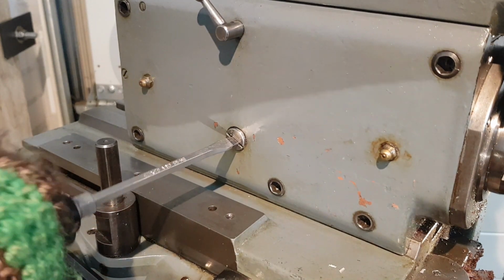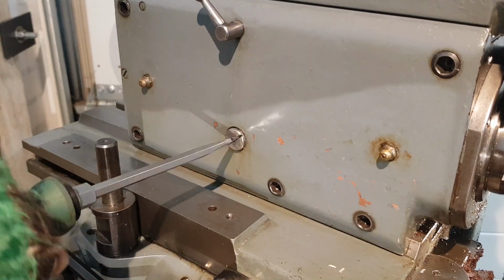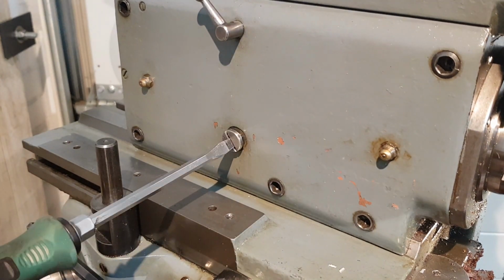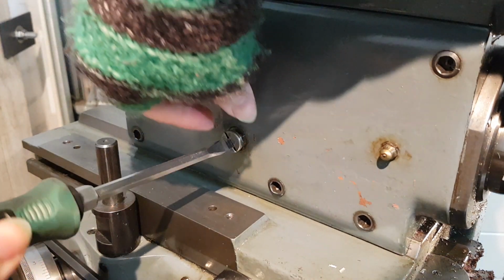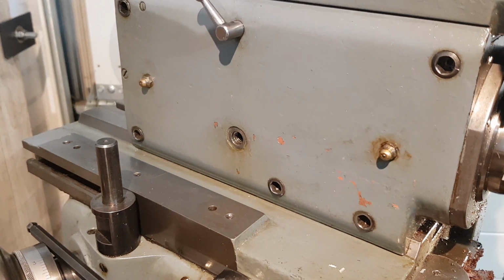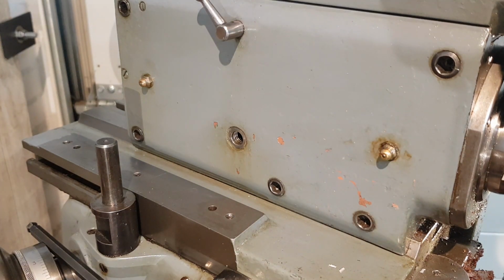So this is me removing this screw number 5. I've already done this earlier and a lot of oil came out of it. But following the manual, there shouldn't be oil running out of it. The level should be below this hole. The first few runs I still had a bunch of oil coming out, but it started to get less. And now a week later, it's almost gone.